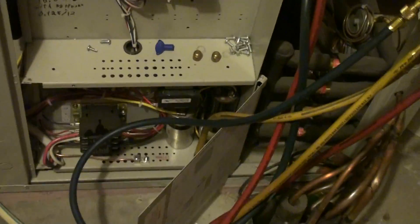This is a geothermal heat pump. Inside, the big round coil at the back is the main heat exchanger. The compressor is down in here. There are a couple of switches — high pressure and low pressure switches — that'll shut it off if there's a problem. On this side, there are the TX valves — there are four loops, so one TX valve for each loop, which controls the amount of refrigerant that flows in those lines so you can measure the superheat. And then of course we have a reversing valve. This particular machine will also run cooling in the summertime for air conditioning.